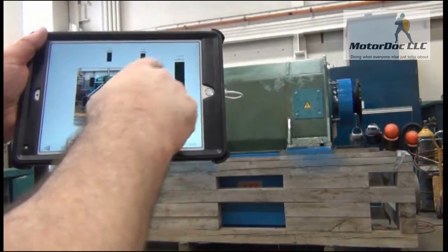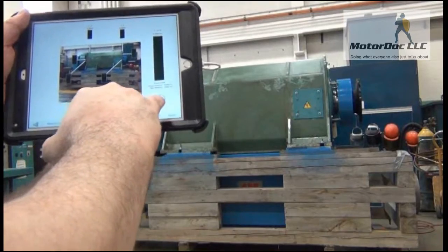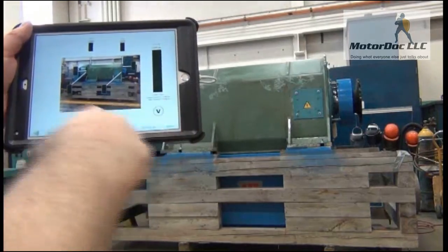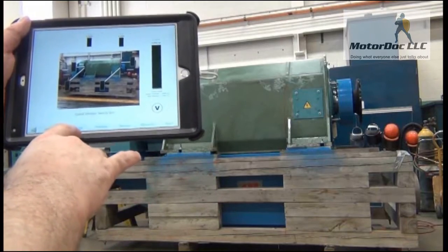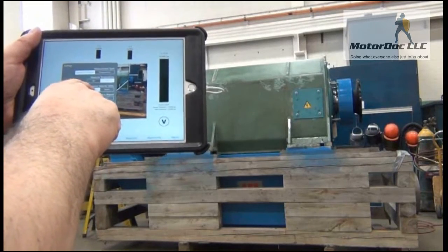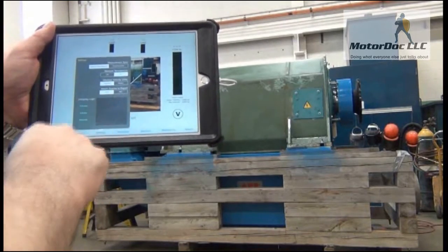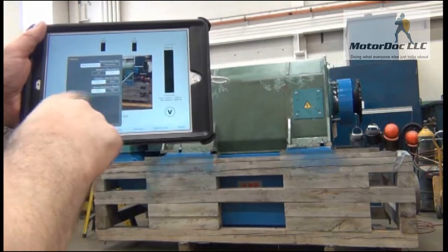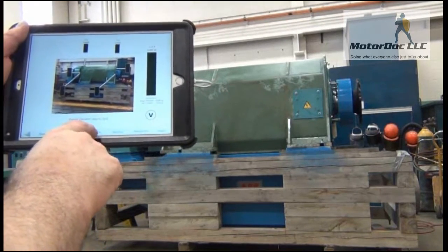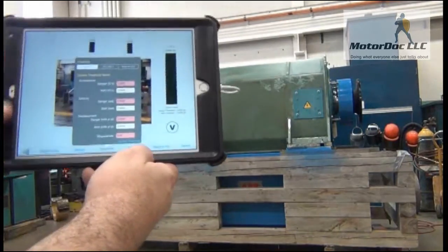As you can see, here's where my different readings are. Once we're ready, I'm going to do vibration and acceleration — just by selecting those. As I select each one and tap it, it's going to give me an overall reading and will automatically save. In settings: I have my temperature probe on, I am using regular readings — I could switch to metric if I wish. Attach spectra: yes, I'm going to attach the spectra. I can also include the company logo, which I will do after.